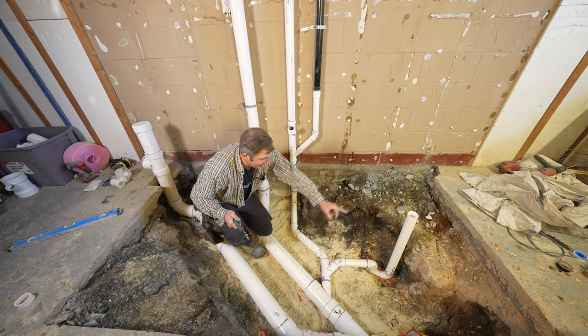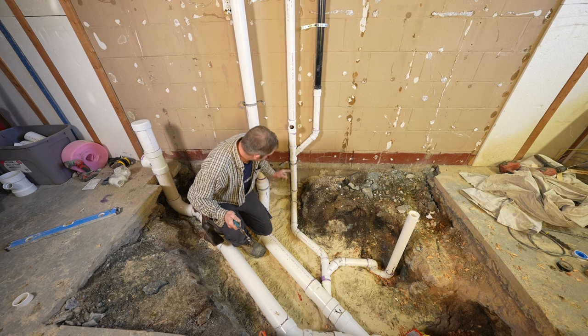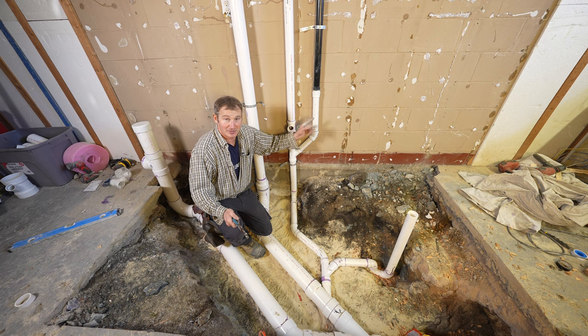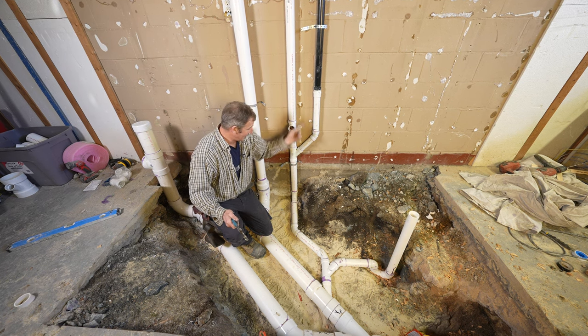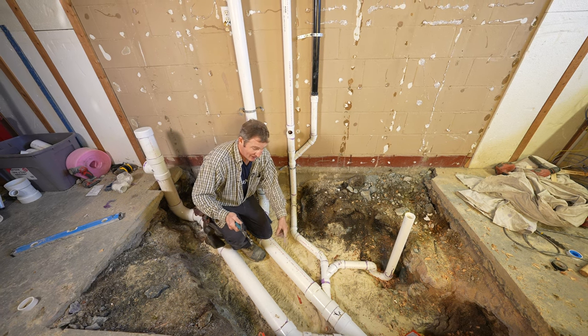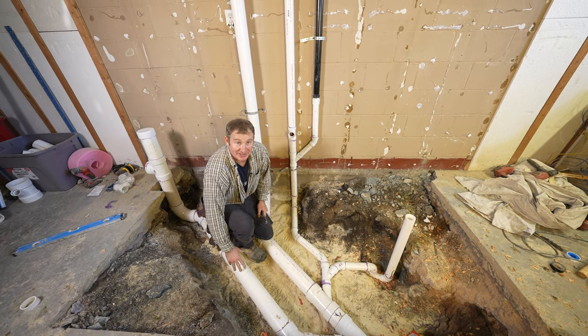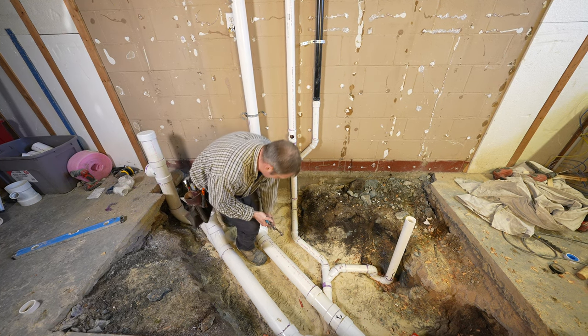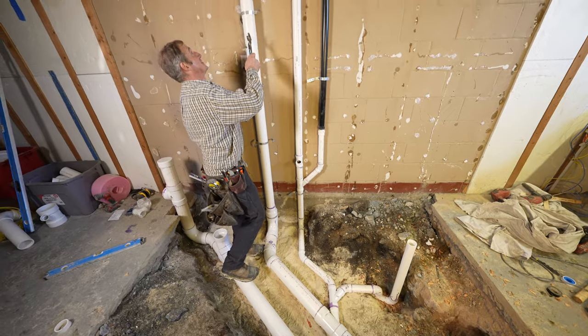But you're able to basically ventilate everything in a basement bathroom with just one single vent. This is considered a wet vent because you have the shower coming into this and then you have your vanity. Now I do have another additional item, a lavatory on the second floor attached to that. So we have four fixtures for this 2-inch wet vent that will be technically venting the toilet, but I also really have a second vent for the toilet, which is this main waste stack coming up. So this is a vent